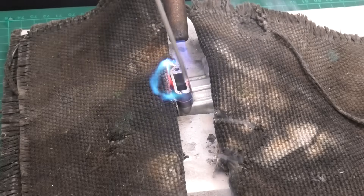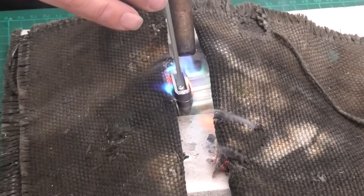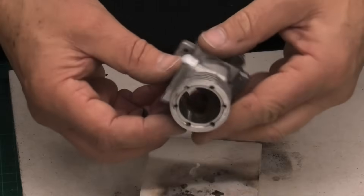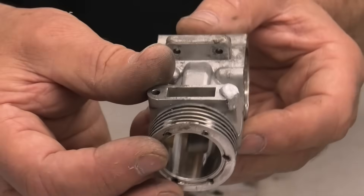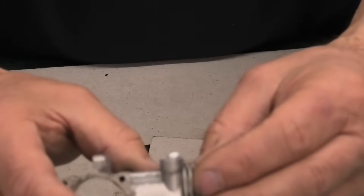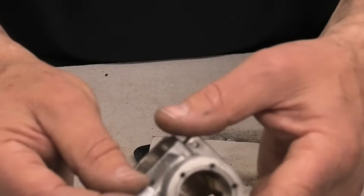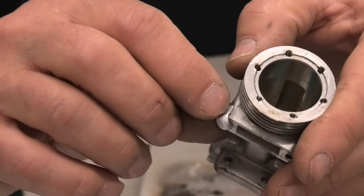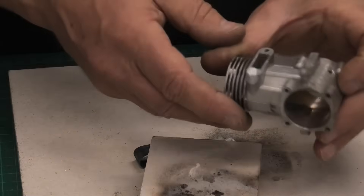There we go. Right, well this is just about cooled now and you can see we've got a great big blob of solder on there. We have no idea how well that's gone in there, but it looked to be going in pretty well. What I'm going to do now is machine this. You can file it - it's quite hard but you can file it - but I'm going to stick it in the mill because it'll be a little bit easier. You can see there's a little bit that's been missed just right on that very corner, but hopefully that will still look okay.